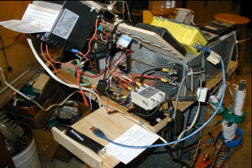Moving on to about 3 o'clock is the back of the 48-volt power supply, and at 4 o'clock sits the DC to DC SSR. If you look hard, you can see a thermocouple probe stuck to the SSR's heat sink. I use modeling clay for this. Just to the left of the SSR is the 75 millivolt shunt, and hiding behind that is a little terminal board that I can use, if needed, to distribute 12 volts DC.